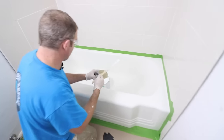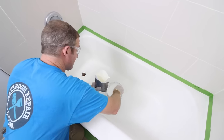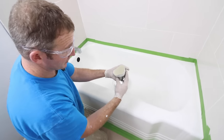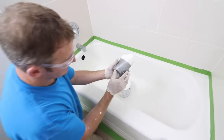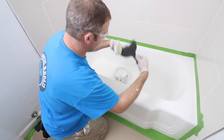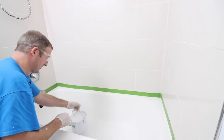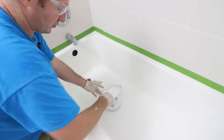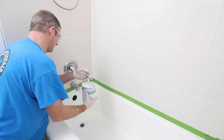After 10 minutes of letting it sit, we'll do a quick stir — just to agitate the material a little bit again before we pour. The scooper that came with the kit, I've duct-taped it to reinforce it because we're going to be doing a lot of scooping and putting back into the can. We can also use putty knives to help get material off the bottom of the tub. I'm going to bend the can a little bit to give it more of a controlled pour — squeezing the pail and pouring along the top edge.